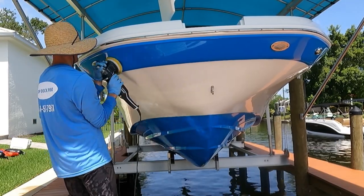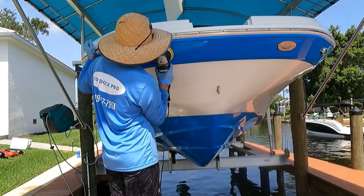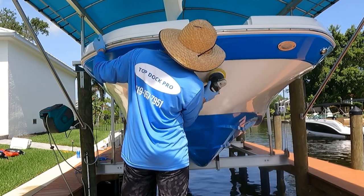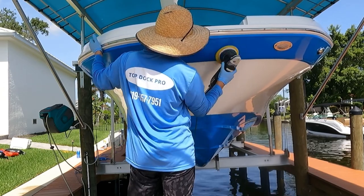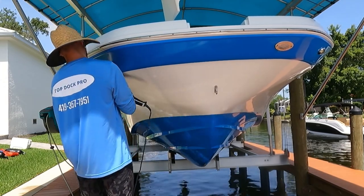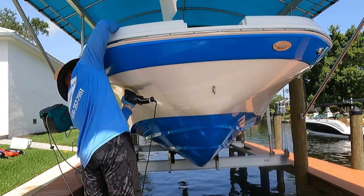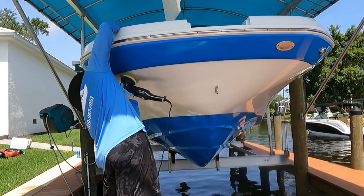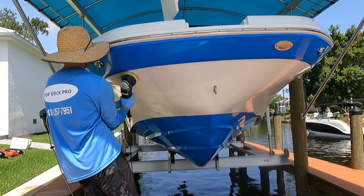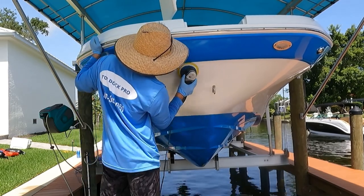Share all this with the client, give them the knowledge they need — this is how you create value and make sure the boat is protected so they're getting six months out of it. Work together with your client to maintain the boat and get them on a schedule where they can get this polymer sealant done twice a year if their climate keeps boats in the water all year round — such as Florida or tropical environments. If you're up north in New York or Ohio, you can get them on a once-a-year schedule.